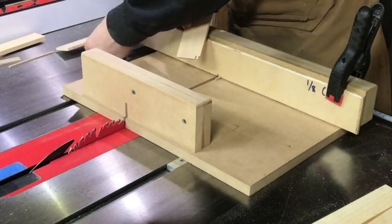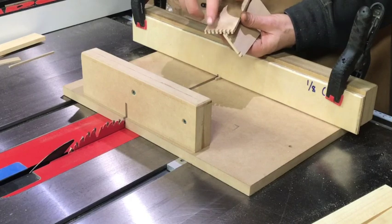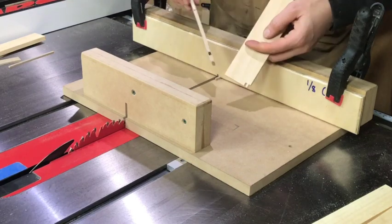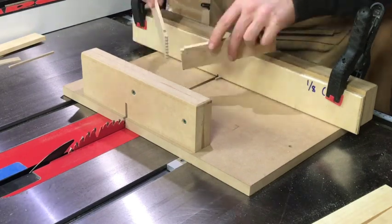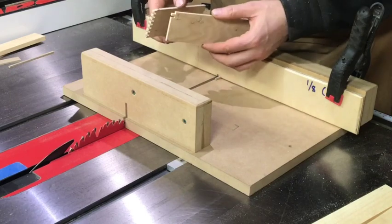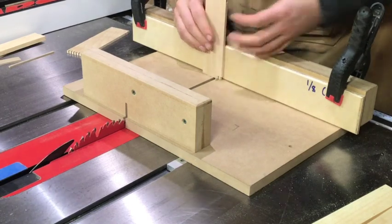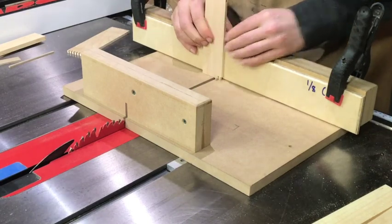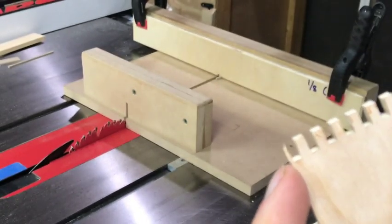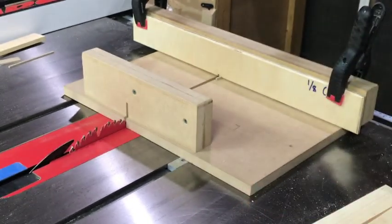From here on out, set the reference piece aside. Remember this is still your test piece — you can make it relatively narrow so there are maybe only five fingers, so it doesn't take long. There's no reason to use a really wide piece for your test; if you get it wrong you'll have to redo it after slightly moving the jig. You can see here again what I was referring to with that last tiny finger — the table saw blade just obliterated it. So again, make the width of your pieces evenly divisible by the width of your table saw blade.